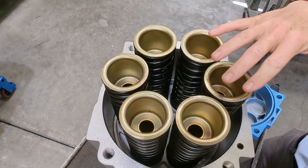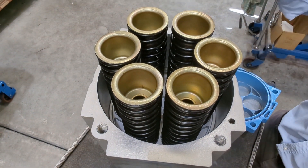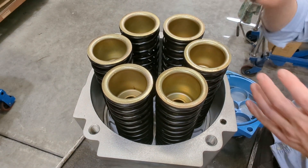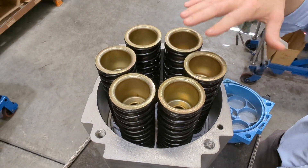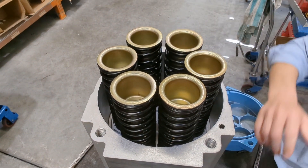These are a pre-packed tension spring. You do have some pneumatic actuators where the spring is under tension even when the end is off — that's what they do. The good thing about this one is they're a lot safer if you do need to take it apart, because it's a pre-spring pack.